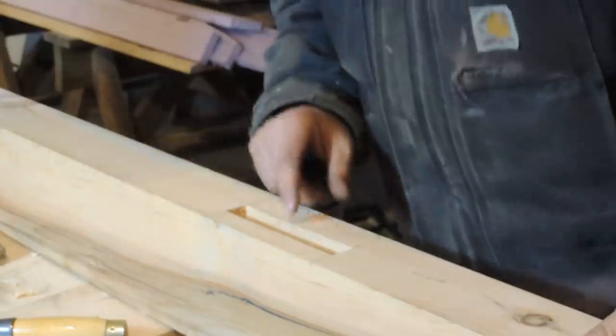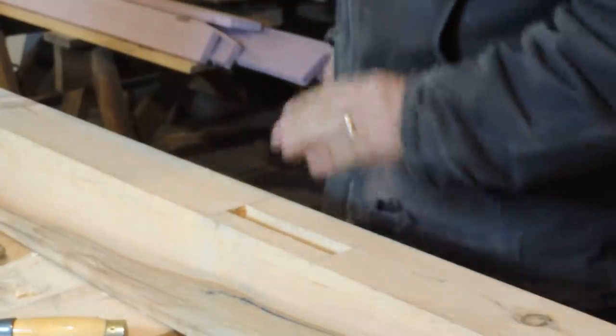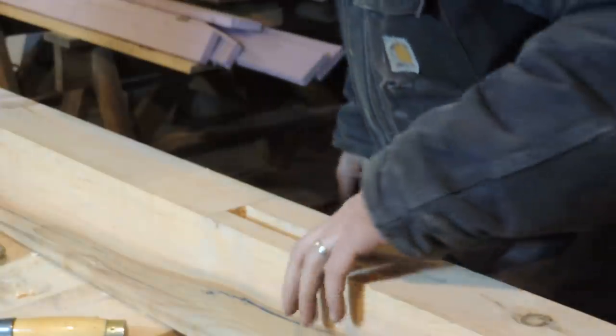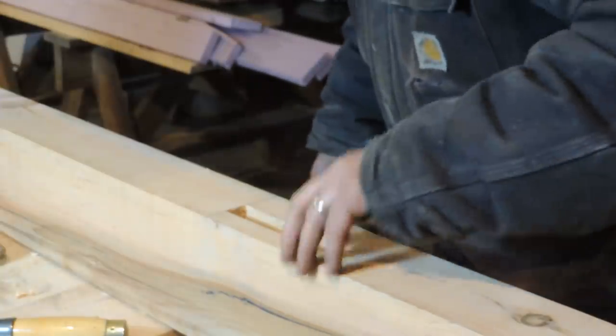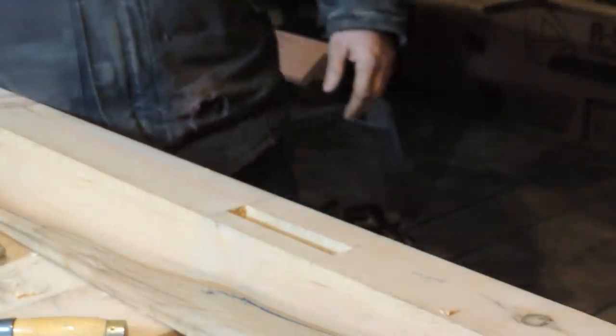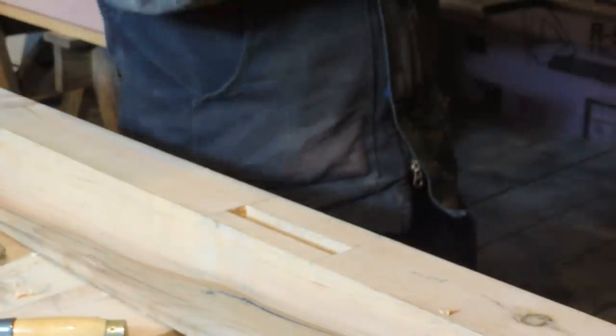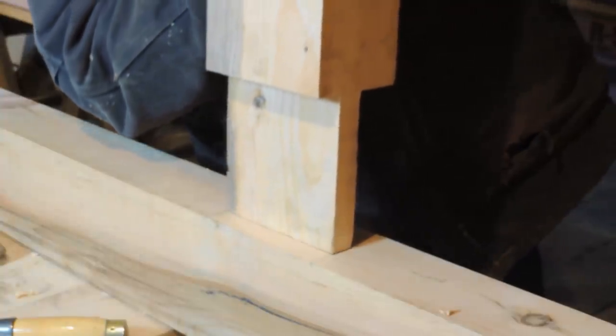Yeah, I'm definitely going to want to get that epoxy to hit this side. It's like a penetrating epoxy, and it soaks into wood, and it makes punky wood really strong again. I've seen guys using it here and there.